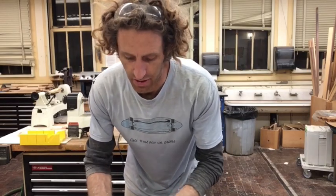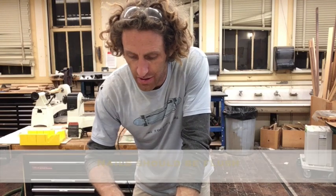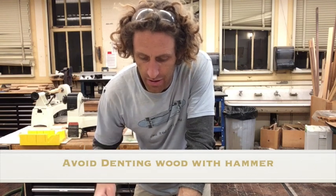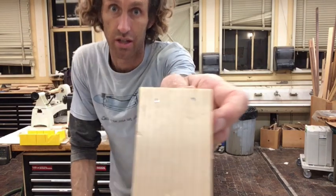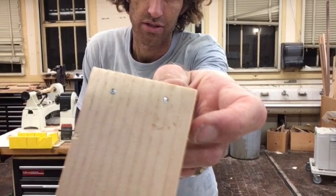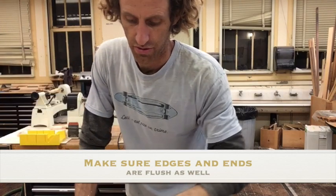This is probably going to be, for a lot of you guys, your third project grade. It's a small project, but I'm letting it fly since we had a week where I was missing. So I want you to do it nice and do it well. I want you to hit the nails so that they're flush and that you're using the hammer flat — so it's hitting flat — so you don't have big dents on your pieces. These finish hammers have a nice smooth face, so your pieces should look nice and smooth. They shouldn't be sticking out; they should be flush to the wood.